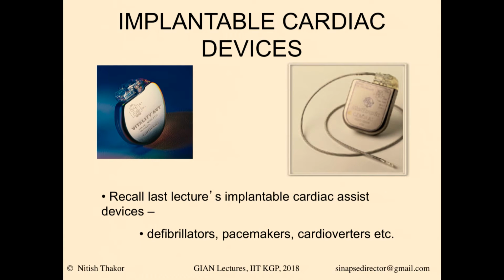And ceramic is already now being tried, because if you are in a metal container, can you transmit data or information wirelessly to it? Because the metal can becomes essentially insulation, like a Faraday cage, exactly. And so if it's in ceramic, then you can have an antenna on the ceramic, and therefore you can transfer data, but it's not as perfect insulation as metal.